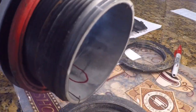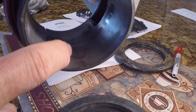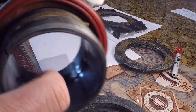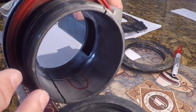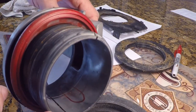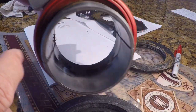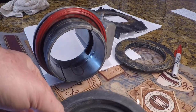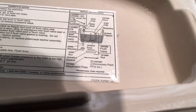Trying to figure out why this thing failed — I don't think I know the answer, honestly. I will point to one flaw I found: there is a vertical crack in the ABS body of the flush valve, but it's tight, you can't see daylight through it, and it's just impossible for me to believe that would allow the kind of volume of leakage we saw — about a Dixie cup of water dumping out every time you flush. The seal, when I inspect it, looks supple; I can't find any holidays in it. I have to go to bed not knowing the reason this thing failed. I spent $47 replacing all the parts and we're back in business.